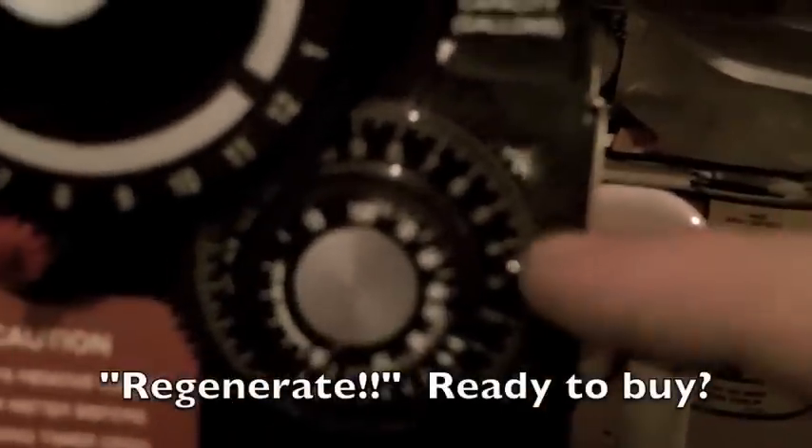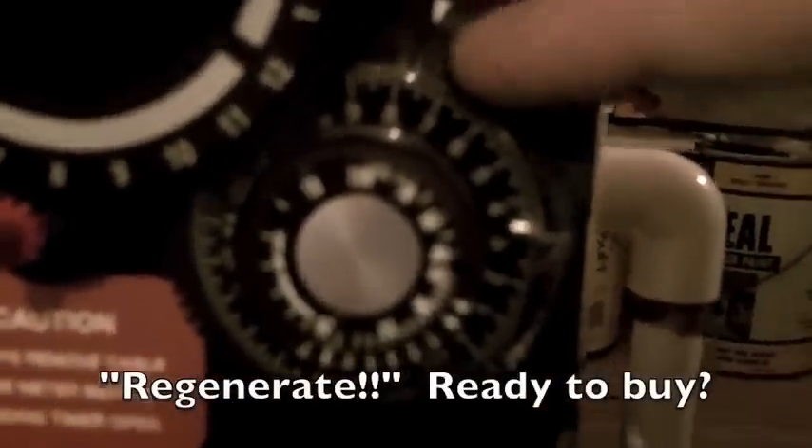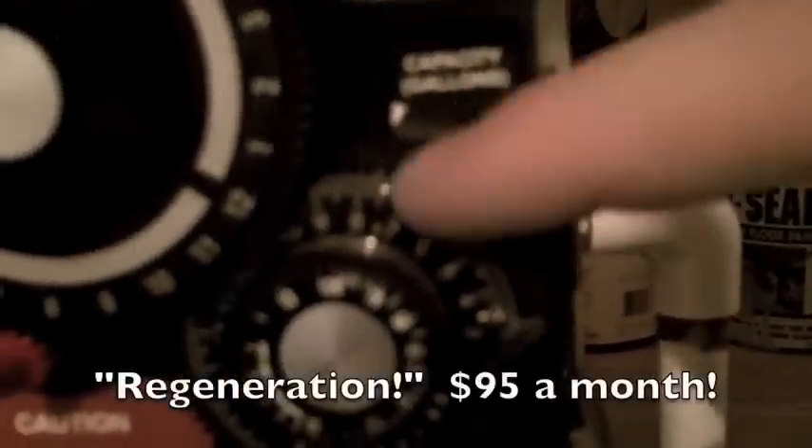This little smaller wheel really determines how often it's going to regenerate your resin filter inside. They say how many gallons of water do you want to go through before the regeneration cycle goes. Basically they figure that up by the number of people. You might have this thing called a people dial out here, and inside is the grain content in your water. You pull this out and twist it and basically you're setting your gallons — how many gallons you want until the next regeneration cycle.